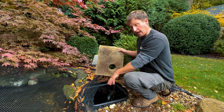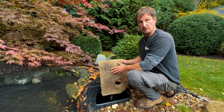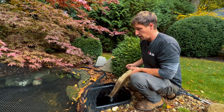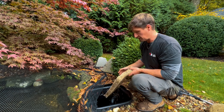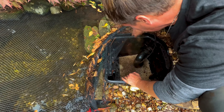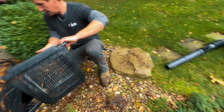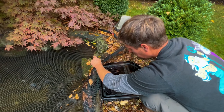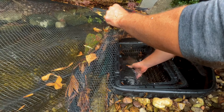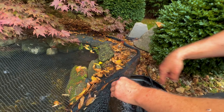We emptied our basket, we pulled out all the debris which made its way past the basket onto this filter pad, we also cleaned out this filter pad, and now it's time to put it back in the skimmer, put our basket back in, and then open up the weir door to allow the skimmer to do what it's supposed to do. So we're going to put this back in — it just fits nicely right around where the check valve is. This basket is one of the best upgrades to these skimmers — it's got an easy-to-remove basket that sits right on these two little clips.